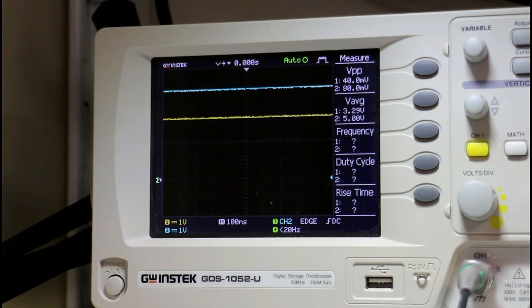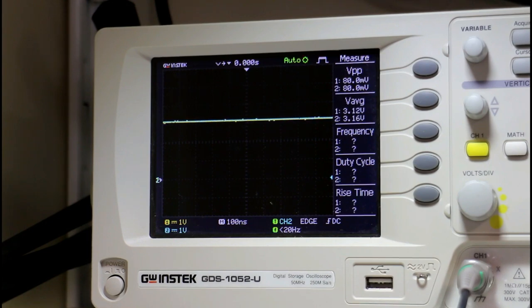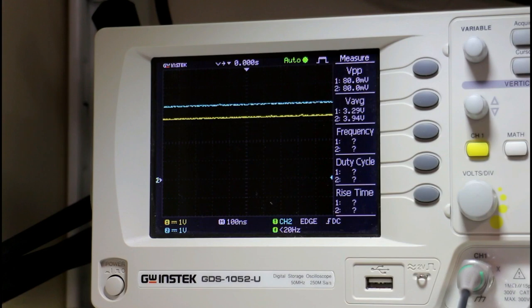Another new feature we added was the change in the voltage regulator. Looking at the blue signal, I started off at 5 volts and we're now dropping the voltage, but you can see our output is still stable at 3.3 volts or very close to it. Now we're into the range of a LiPo battery — around 3.6 volts would be pretty discharged — yet we still have 3.29 volts coming out of our regulator. Only when we fall below 3.3 volts do we start to see the regulator drop.